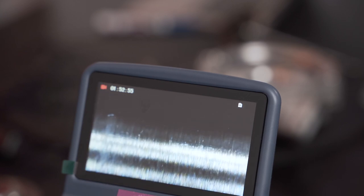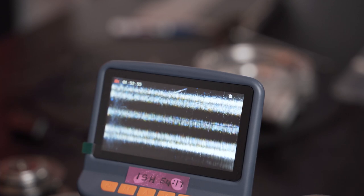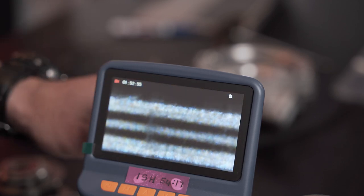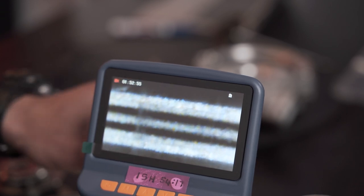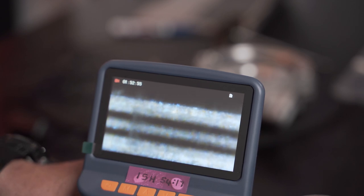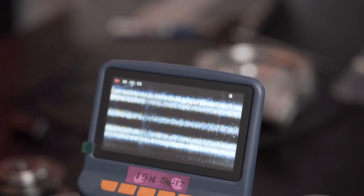So there you can clearly see the surface of that shaft. As you can see, it doesn't have the same machining marks as what the compressor wheel does. There's a reason for that, because these shafts are ground. They are not cut with cutting tools. To get the final size, which is quite a precision controlled size on your turbine shaft, you need to actually grind that. So that gets done on a cylindrical grinder. That's why you can see that the striations you see on the shaft are completely different to what you've seen on the back of the compressor wheel.